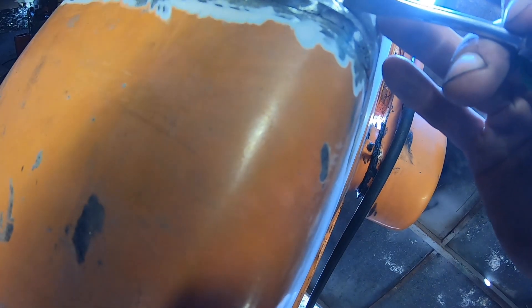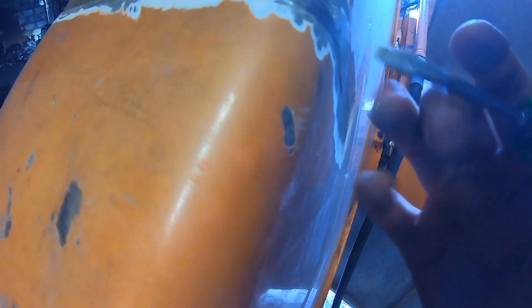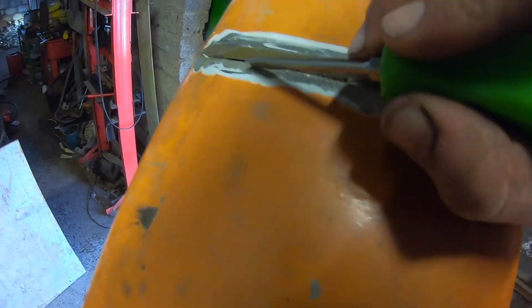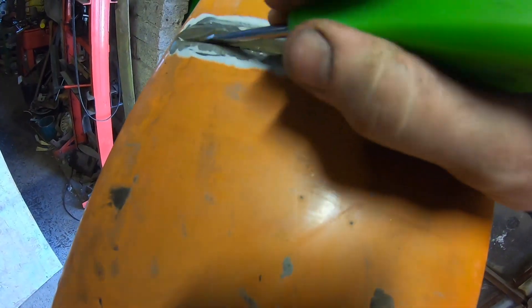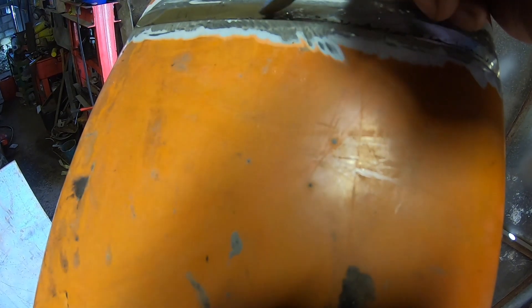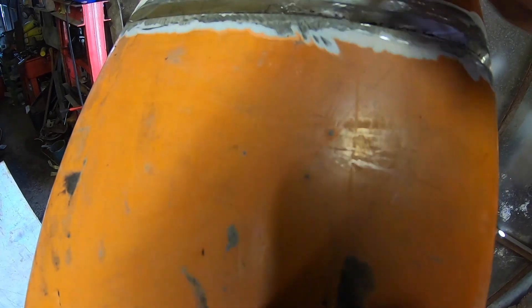You can see this here now — I'm not close yet, I have a bit to go. The crack is there, so I'm kind of in the wrong place here on the corner, but it doesn't matter. I'll have to cut back a little bit more. I'll put more weld on this edge where it needs more strength anyway. The crack — I've pretty much hit it where it needs to be over here. I've cut right through it and it actually goes up in a little bubble here, so I'll probably cut an extra piece out till I get down to the bottom and fill it across then.